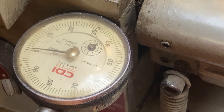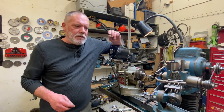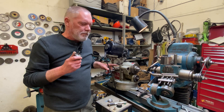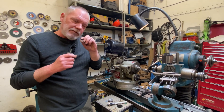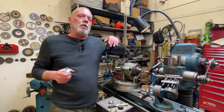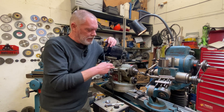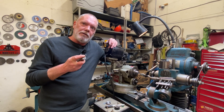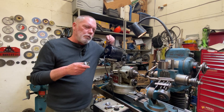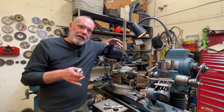Basically what we're looking at is: to get the proper amount of relief I wanted on a 5/16th diameter piece, the total throw of the machine was 20 thou, and to get the same relief over the same 32nd of an inch distance on a bigger diameter piece, the total throw had to be 60 thou. So the moral of the story is, when it comes to radial relief specifically, the relief you dial into the machine is completely dependent on the diameter of your workpiece.